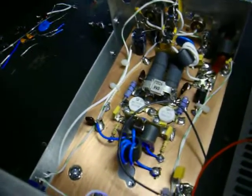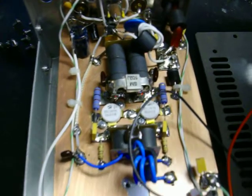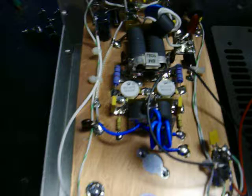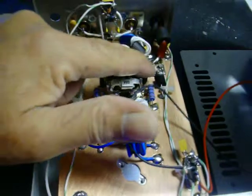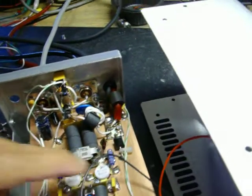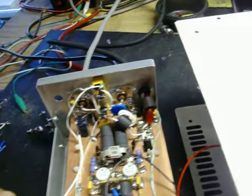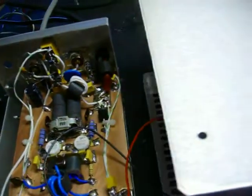Everything's new in this amp — everything, everything's brand new. This is for sale on eBay, so get your Fat Cat amp today. Nice little transistors — two times 2SC2879s, matched set. I have matched all these capacitors — all matched — even the feedback, and tuned out the output, tuned out the input. And there's a regulator right there which keeps it at 12 volts.